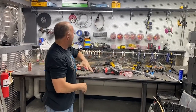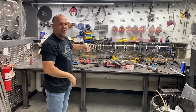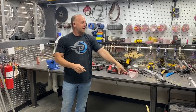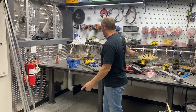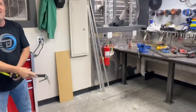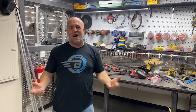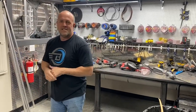I can take the cardboard off there. All the dust can go to the back — the heavier stuff can't lift and go out the fans. Any heavier stuff will go down to the back of the table. I can just brush the debris into those vents — they go all the way down the whole table. There's a big giant pipe that goes underneath there, goes into this filter. It has a cyclone effect, drops the heavier stuff in a trash can for me, filters the air. If I cover those up, I've got floor vents too. I take my air hose and just blow the floor and the table into the corner under the table, and all the dirt and debris goes right into the filter and trash. We've been using it for a while, so I thought I'd give you a quick tour. It's finally done, and man, it makes life good. It's also ice cold in here, so when it gets warm out there, it's like a little chiller room.